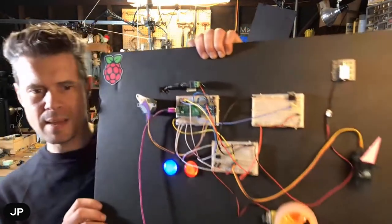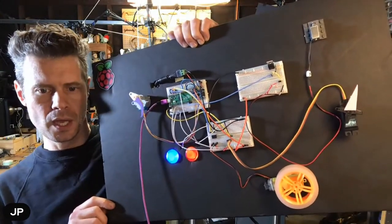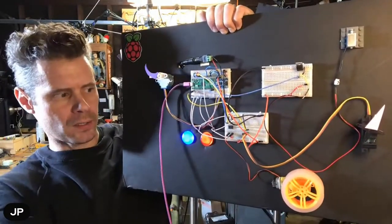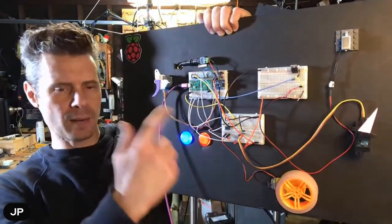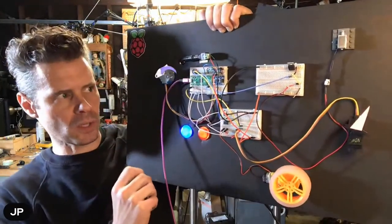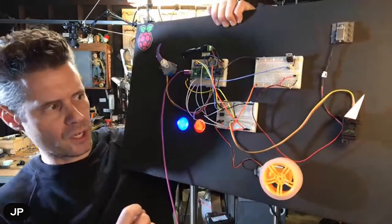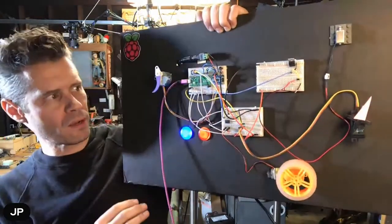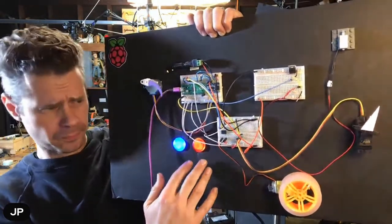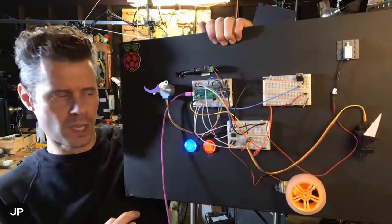As well as one of these sort of demo boards — we've done this sort of thing before when we did CircuitPython. I built a big cardboard demo board so we could show a bunch of different motors running. I've got a solenoid, servo, DC motor, and a stepper, plus a couple of buttons. I'm laying this out on a few breadboards so that things aren't all crammed together — you can see the little MOSFET that drives the solenoid, an H-bridge motor driver, and a stepper driver. It is all being run off of this Pico, which is running CircuitPython.